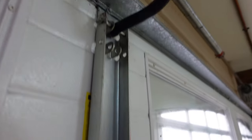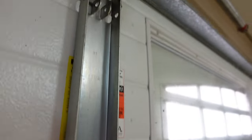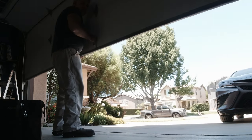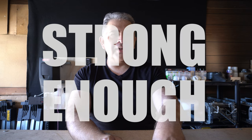And you're probably thinking, big deal — a pair of 225 should be able to balance out a foam injected or polyurethane injected insulated garage door. And you would be right in saying so. Nevertheless, the issue with this door system is that it had really poor balance. In other words, those 225 wire springs were insufficient, not strong enough to lift or balance this particular insulated garage door.